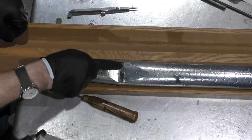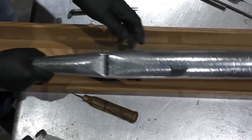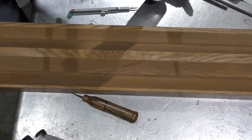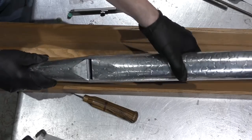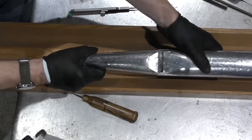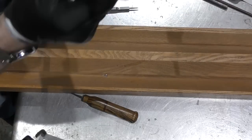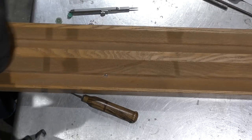All right, the upper lip has now been cut to the correct dimension. Take the metal shavings and dump them out, because when you cut that away, the metal shavings just fall in there. You don't need that. So now the other part, which I would call the pre-voicing process, is that you have to open the toe of the pipe, right? Because that's closed off. It's been coned in at the shop, but no air is going to get through there.